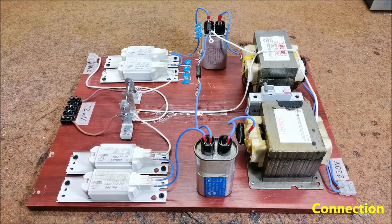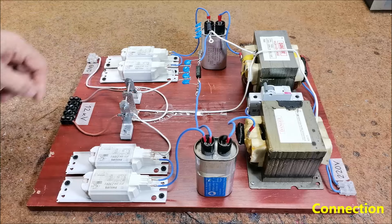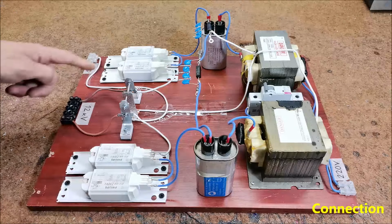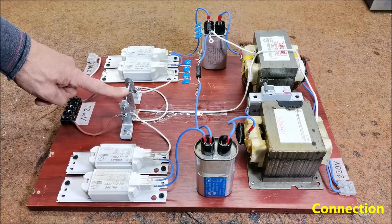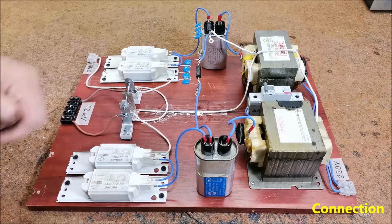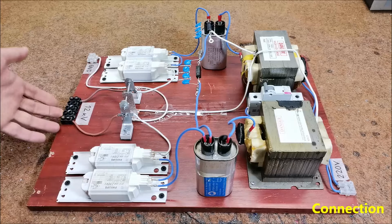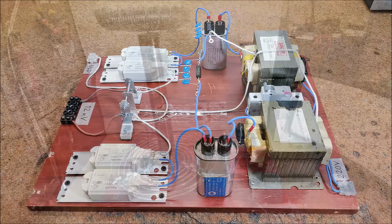Unfortunately, resistors with such high power are very difficult to obtain, so I successfully used 4 old ballasts from fluorescent tubes, which are actually chokes. In the following, there is a symmetrical safety gap where the grounding is in the middle, which serves to protect microwave oven transformers. With this, the power supply part is ready and we can connect it to the rest of the components of the Tesla transformer.